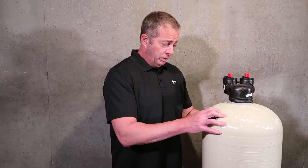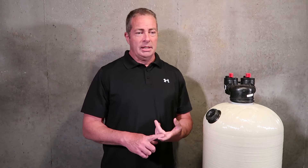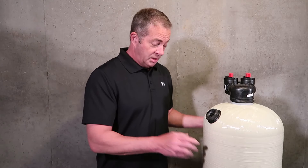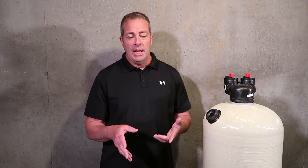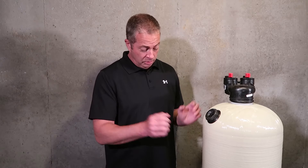With the non-backwashing type system: easy to install, no drain, no electric. You can place it just about anywhere within close proximity to your well tank. If you're down south and don't have basements — crawl spaces with a dirt floor — you can dig a couple of feet down, slide this in, then add your calcite. We've done that for customers on Maryland's Eastern Shore where a lot of houses just have a dirt crawl space and the well tank is under the house.